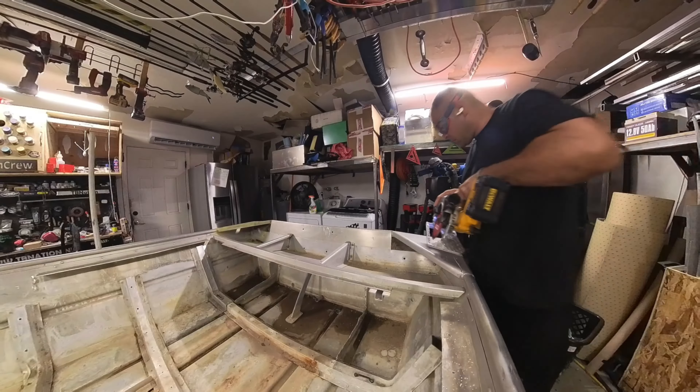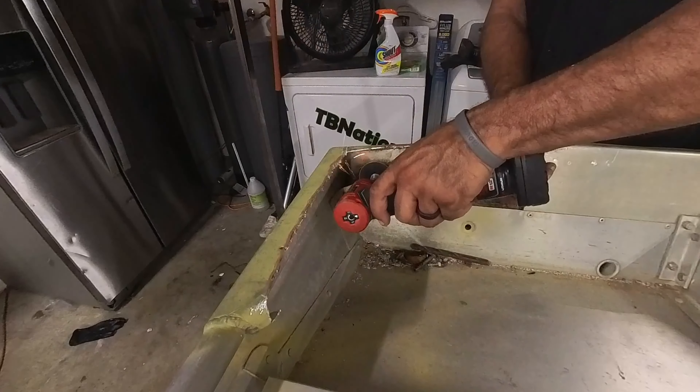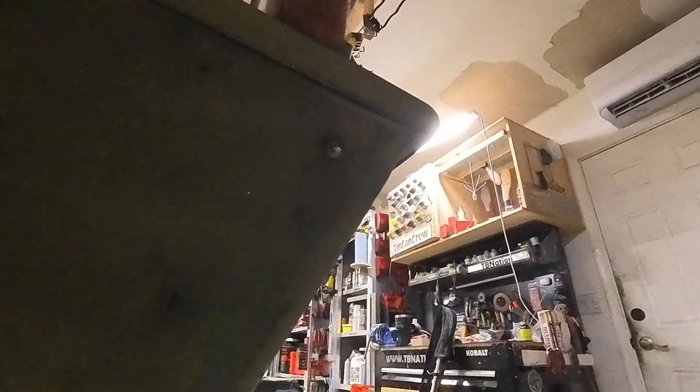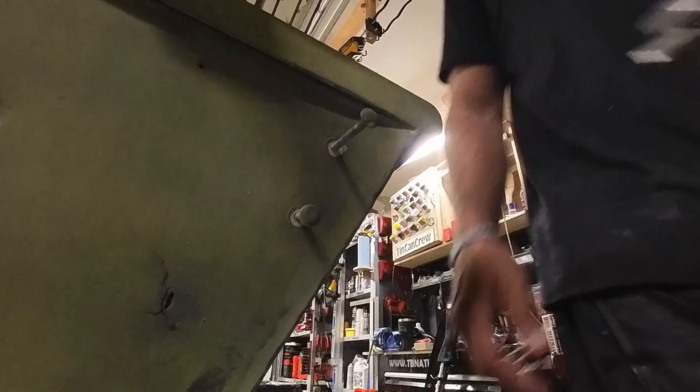Just cut the inner part of the triangle off — do not cut all the way into the tubing; try to leave that intact. If you've got to grind the bead off just to get a clean platform, that's fine. Also be prepared for the jankiest bootleg bolting system ever: there's a collection of aluminum, stainless steel, and possibly regular steel hardware running through the transom and subfloor. They used whatever they could get a hold of. They also had these gigantic two-inch aluminum rivets with steel toppers that we're pounding out now with a punch.